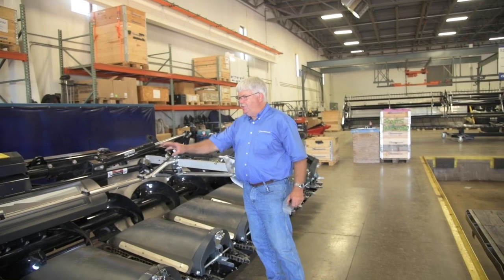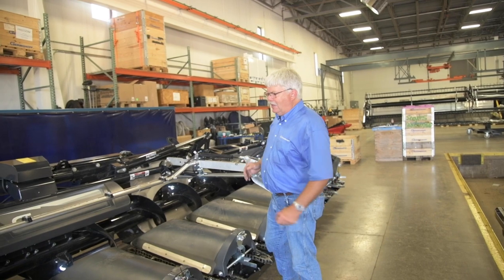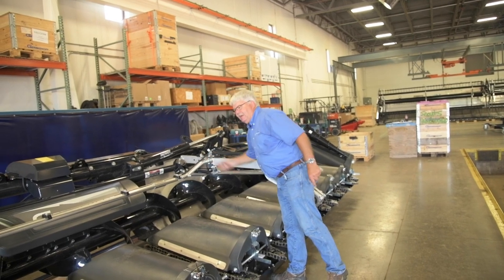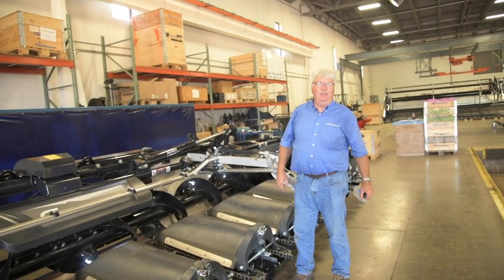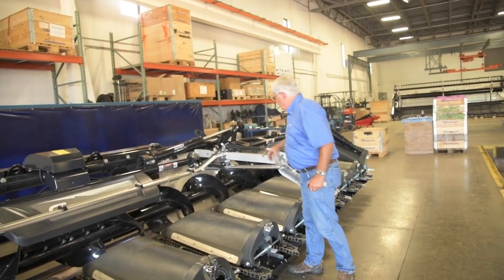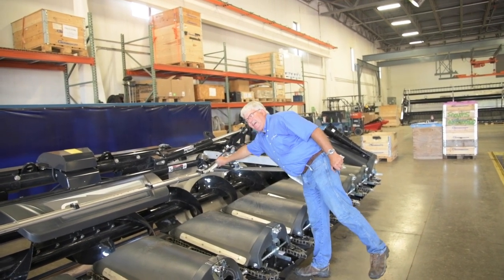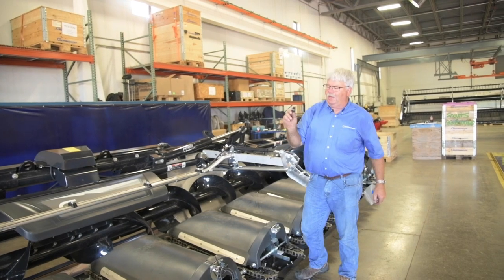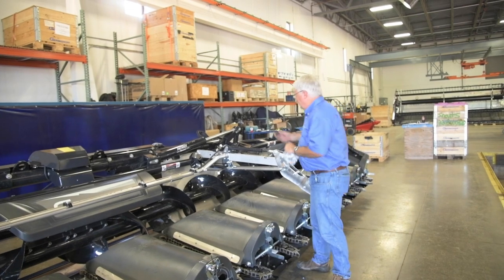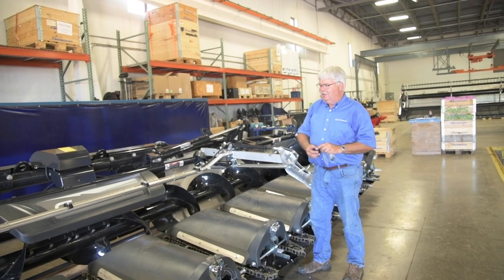After we've got our support tube in place, we want to get it centrally located between the two arms — roughly the same distance from the splice or frame bracket on each side. It's not critical but it'll look nicer centered. Once in place, tighten the eccentric rings and set screw. The last step for this part is to put a little silicone or suitable glue on the plug and insert it into the end of the pipe to keep it from filling with debris.